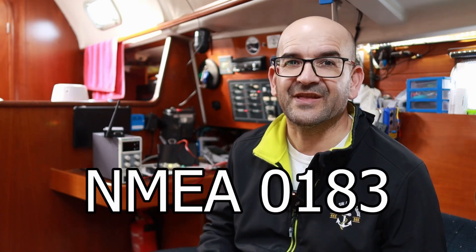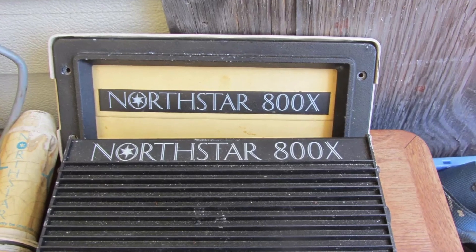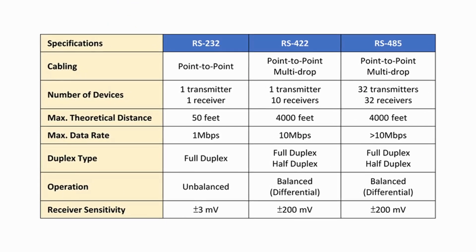All this is going to work thanks to the fact that the protocols used in boating since the beginning are very similar — sometimes identical at the physical level — to industrial protocols used massively in other industries. This is the case of NMEA 0183, one of the first communication protocols between devices introduced in the nautical world. The NMEA 0183 standard belongs to the private NMEA organization, which was founded in 1957 by a group of electronics manufacturers to encourage communication between devices of different brands. It is a proprietary standard of that association and is not in the public domain.